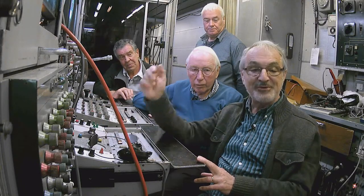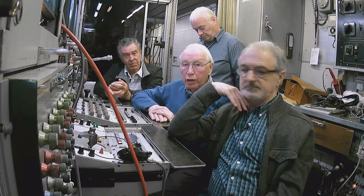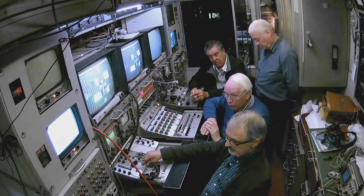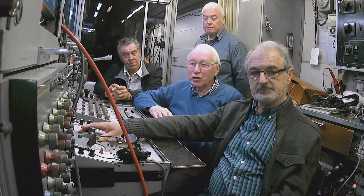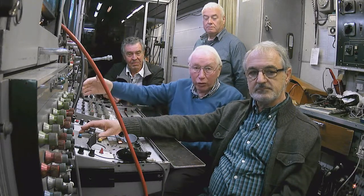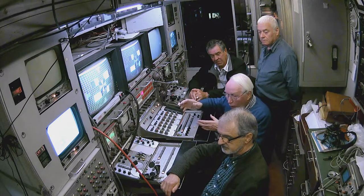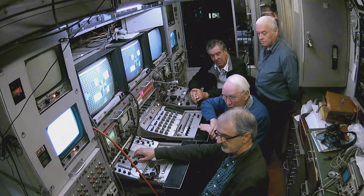If it went wrong, there was a shout on production talk: Camera one, what are you doing? One of the areas that caused a lot of problems was when we had long cable runs across places like a golf course or up mountains. The cable was supplied in 200-foot lengths maximum. The PC-80 cameras were eventually modified so they were run up to 5,000 feet of this, which is 25 sections, using a 101-way cable. So there was considerable scope for faults to appear. There was no way initially of assessing where in these multiple joints the fault was — every single pin has got to work. We began putting a camera body on a golf buggy and driving down step by step along the cable, checking each joint. The first basic fix was to spray it with a cleaning solvent at that joint. If that cleared it, you were out of trouble; if not, you had to get the riggers to take another length out and change it.